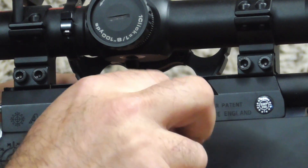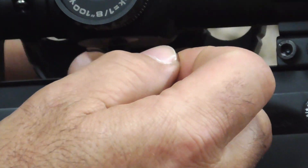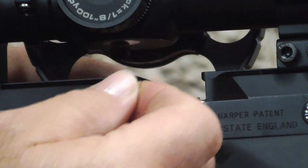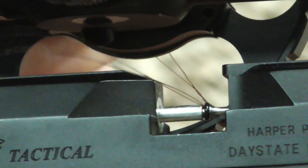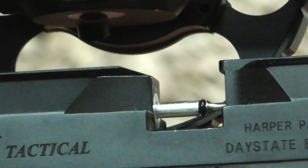We're actually threaded onto the probe, but not over the ridge that makes the seal — that is where it needs to seat. I've got the loops of fishing wire. Hold the probe, and I can just pull them back now — so that's gone over the ridge. Just remove the fishing wire, and the probe seal's changed.